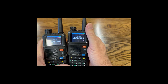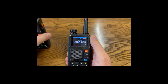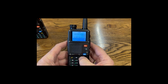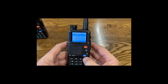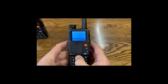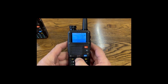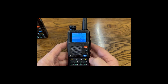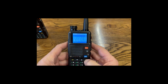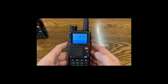Let's take our first radio and put in the CTCSS subcode. We go into the menu, then into Program Radio, and navigate to CT. We go into Receive CTCSS and enter a code — let's put in 79.7. Then we go down and also put 79.7 into the Transmit CTCSS. Now let's exit out.